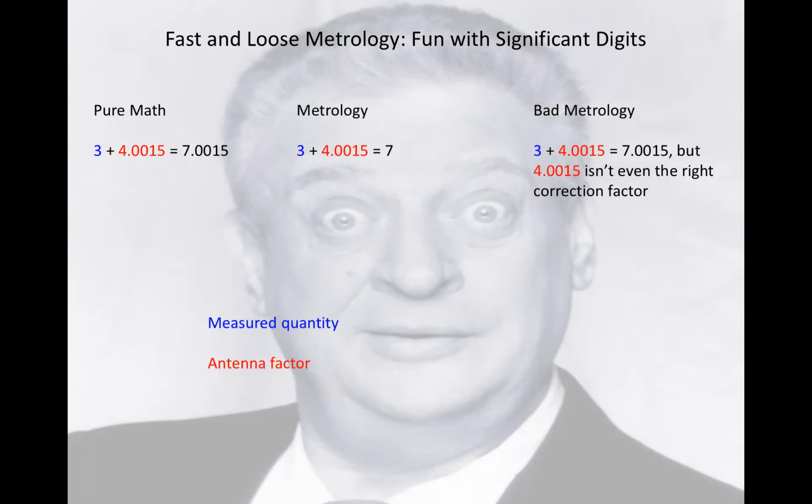Kim, is your suggestion to have the standard prescribe only one calibration method, so that if it's used as the standard, everybody's going to do the same thing? Well, that everybody needs to do the same thing. Even if I don't get my way, even if everybody out there thinks that separate horizontal and vertical antenna factors are the cat's meow, then everybody needs to do it that way. You can't have some people doing it one way and some people just using a single antenna factor.